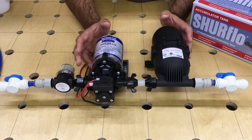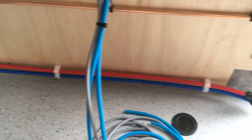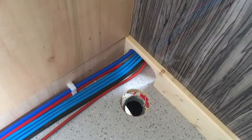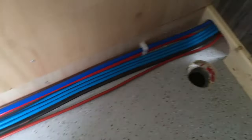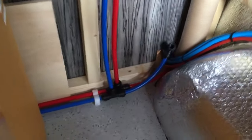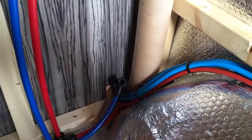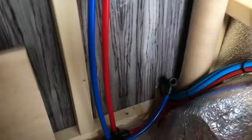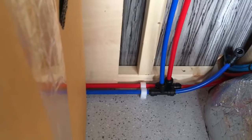Let's jump into the vehicle and have a look at the installation of the pipework in the van. I've got the first-fix plumbing installed for the kitchen unit — we've got hot and cold water running along the bottom coming up to our new tap. We've got hot and cold services coming through here: a cold feed to the boiler at the top teeing off to feed the toilet, and then underneath that is the hot supply from the boiler coming back into the garage. On the other side of the shower cubicle you can see the hot and cold pipe coming through at low level — I've got a T just in the corner there ready to pick up the hot and cold supply going up to where the shower mixer is going to go, and then carrying on to the kitchen sink.